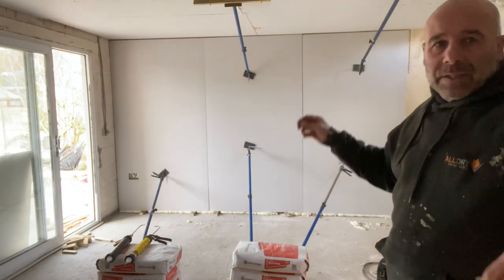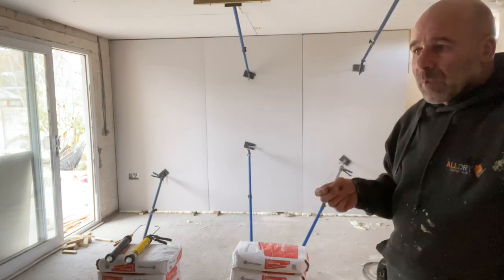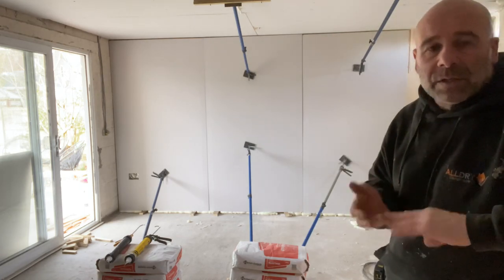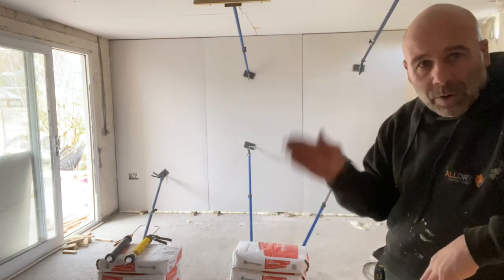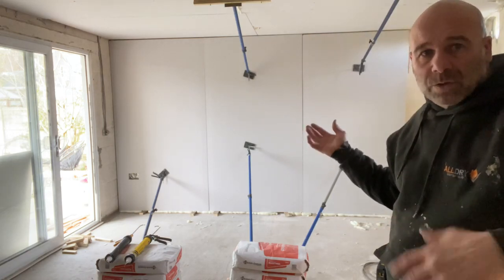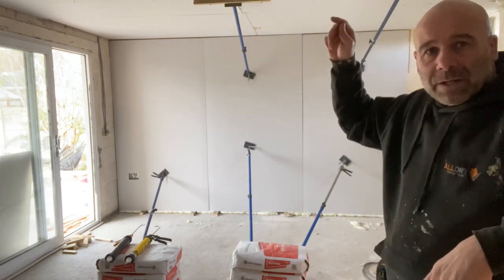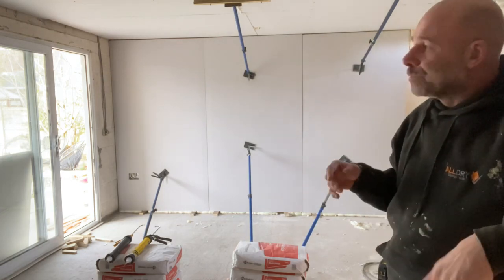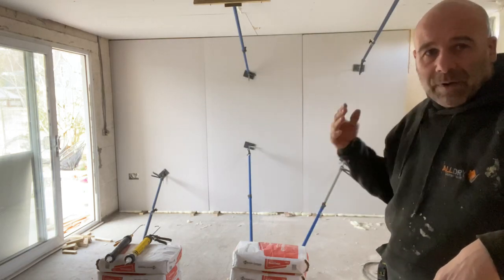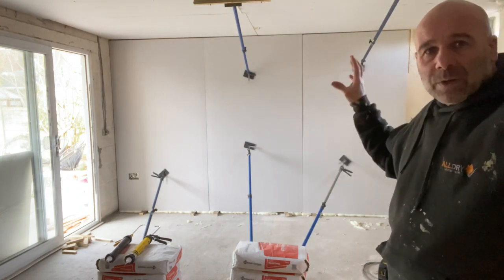If there's ever any penetrating damp, I don't think there will be, because we're going to have a different system on our side. Because it's got acrylic dots on and Insta-stick, there's going to be no bridge. You've got a cavity left behind the board, so any ingress is going to be on the blocks coming in from outside. The 4-inch concrete blocks are quite dense, so unless something is actually dripping against the building, it's not going to come in. But it can happen because gutters can leak. What will happen is that ingress will just evaporate, so you'll not see it on the inside. But like I said before, they're going to sort the outside out anyway.